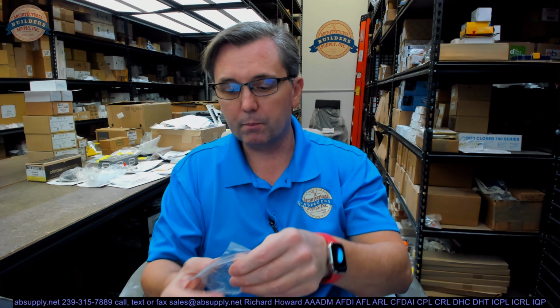I had a client who needed a quote of 2 Baldwin mortise locks. Lock bodies, the Plymouth style grip handle, trim on the inside, and got to talking with the client about the quote and about the client. Turns out they wanted a quote for 2 locks. One lock was fine. It worked perfectly fine. The other lock, and what created or necessitated the conversation in the first place, was the fact that it wasn't operating correctly. We dug deeper into it. We discovered that there was a broken spring inside this mortise lock. And I asked the client, how old are these locks? When do you think they were installed? He says, I know exactly, because the owner told me these are original to the house, and the house was built in 1977.